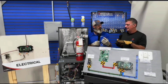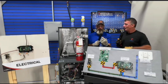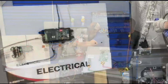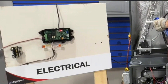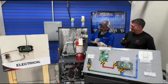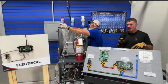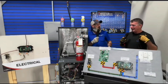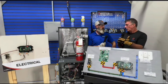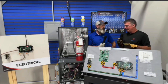Remember, R134A is an A1 refrigerant — not an A2L — but I have a theory that we're actually testing for fluorinated chemicals. So let's see if we're going to set off our refrigerant leak detector with R134A, an A1 classified chemical. Oh, I see some changes — there we have it. And within 30 seconds we start the blower motor. So I'm going to work with some of our refrigerant detection sensor manufacturers to see what we're actually testing for. I mean, we have to be testing for fluorine, hydrogen, or carbon. That's an HFC chemical, but we're actually detecting it with our A1 gas as well as our A2L. Pretty interesting.